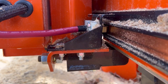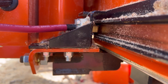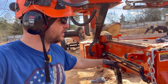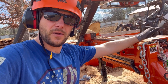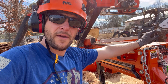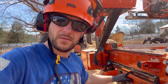It's got to be at a little different angle so you can see there's just enough of a gap between that and between these two contacts — hydraulics — that it's not making good contact. For my YouTube community out here, I understand why this safety mechanism is on here so that hydraulics cannot work if you're in a log and somebody accidentally bumps something. However, I work alone, so the odds of my hydraulics getting bumped while I'm in the middle of a cut are very slim. What have you guys done, if anything, to circumvent this safety measure?